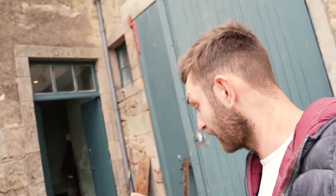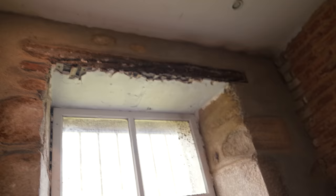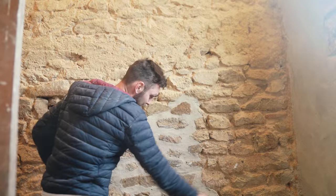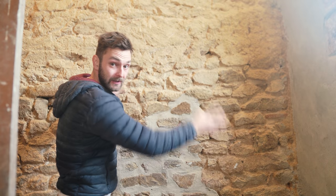I'm just about to start the second wall — blasting it with the machine. Here's the first wall done; it's quite hard to see with the light from the window. This behind me is the next stone wall we're doing. I'm going to render this the same way I've done the first one. I've picked out a big bit in the middle which I've pointed up, so I'm going to leave that exposed as a sort of feature patch. Anyway, let's just get this sprayed.